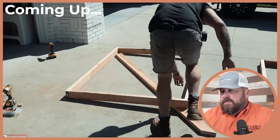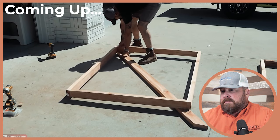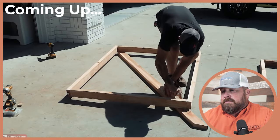All right folks, let's talk reinforcement. Typically with reinforcements of these gates to prevent them from sagging, you want a reinforcing piece that runs from the post side of the highest point clear across the entire gate towards the opposite end, lower side. He said from the high point on the post side to the low point on the away side, which actually you would want it opposite.